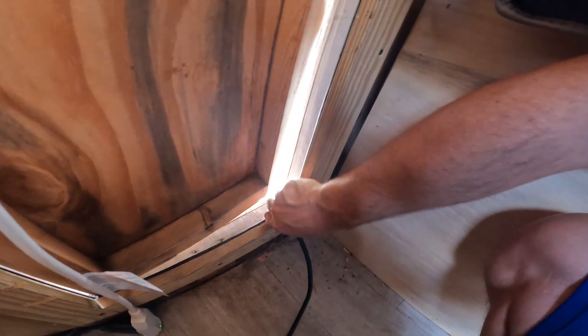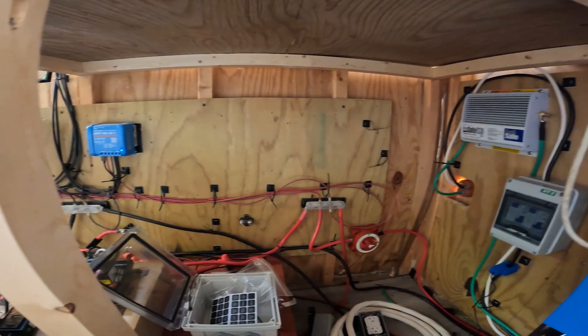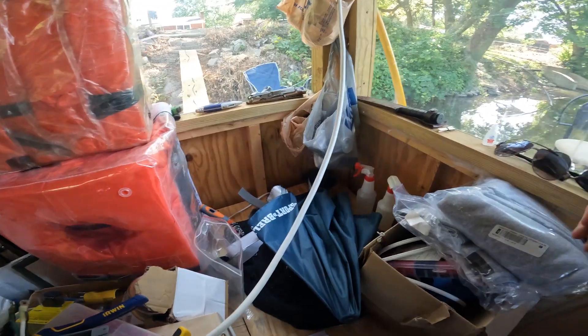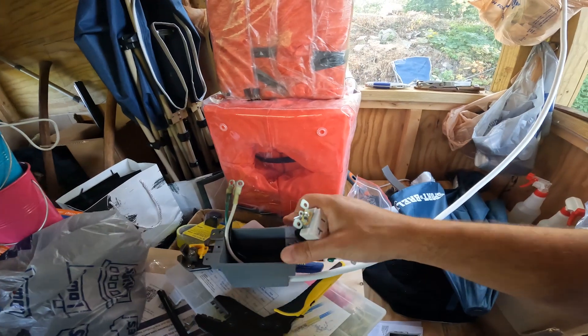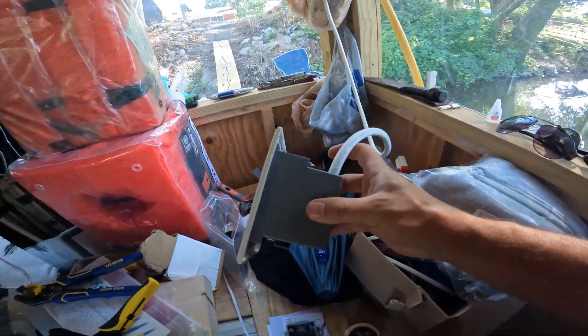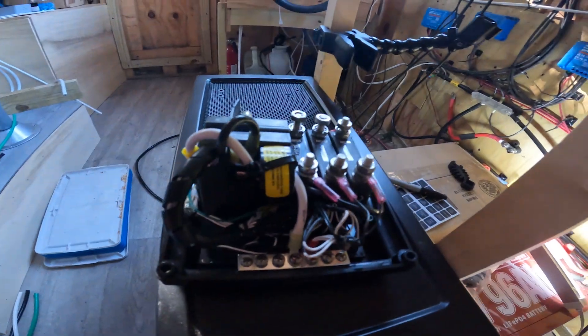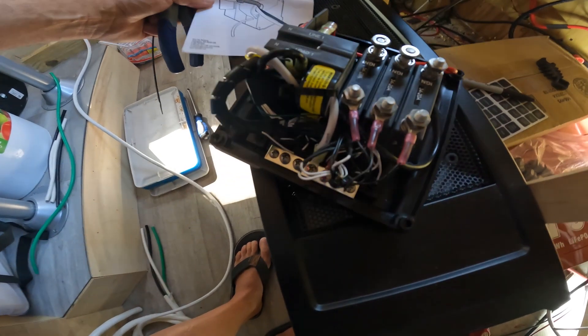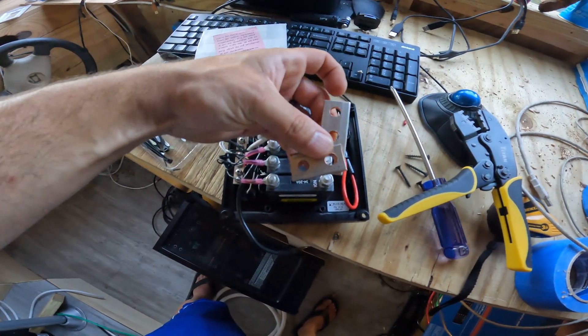It's another hot and steamy one today. Got the air conditioner going. I got the extension cord going through this little gap right here. Today I'm going to be working on all the AC electrical so that way we won't have to run an extension cord out here. The idea is to make like a backrest to the bench — I'm going to have an outlet in the backrest. Just finished this little box, installed this outlet right here, all four boxes wired up. The last thing to do — wire them all to this thing, wire that thing to this thing. Made two bus bars to go kind of like this. Didn't turn out bad.